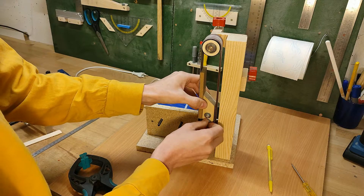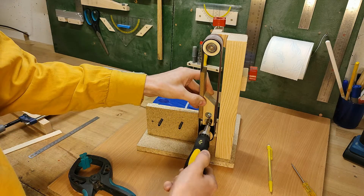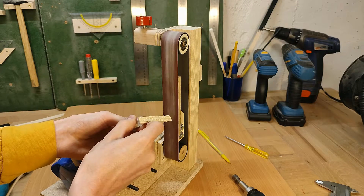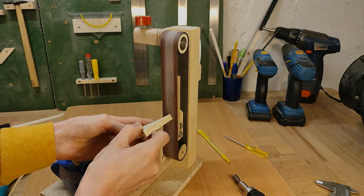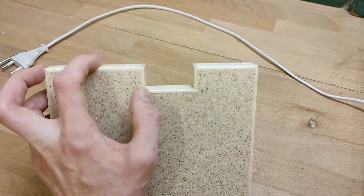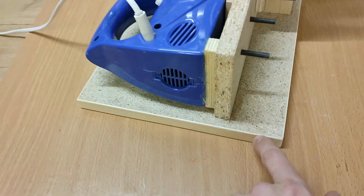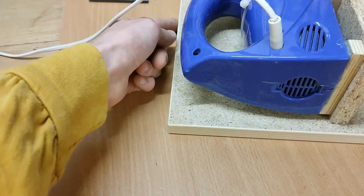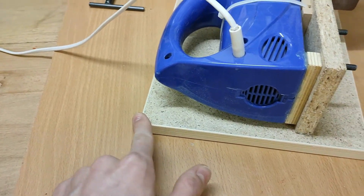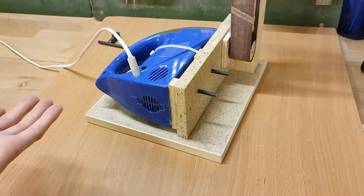Because of these oversized holes we've got quite some room for adjustment, so I'm just gonna adjust it so it just barely touches the belt. And we're off! I finished up edge banding the tabletop, even put something inside this cutout here, and then suddenly decided I should do the edges of the base as well using some very thin strips, because technically these edges won't be covered up, so the corners would be pretty much endangered. In hindsight I should have done that right at the beginning - would have been a lot easier - but I didn't, so never mind.